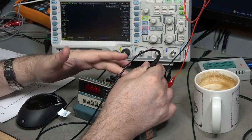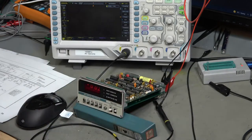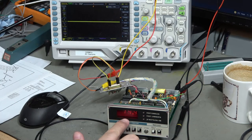That final test basically shows that the integrator never outputs a slope that reaches the test threshold - we never actually trigger anything other than zero. Now we have to move across and look at the first few stages of the analogue input. The first stage amplifier running into the integrator - nothing's happening. Okay, that definitely shows that's the problem: the ADC input stage isn't producing a signal.